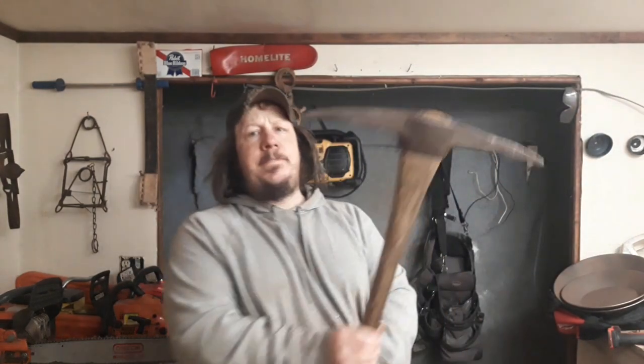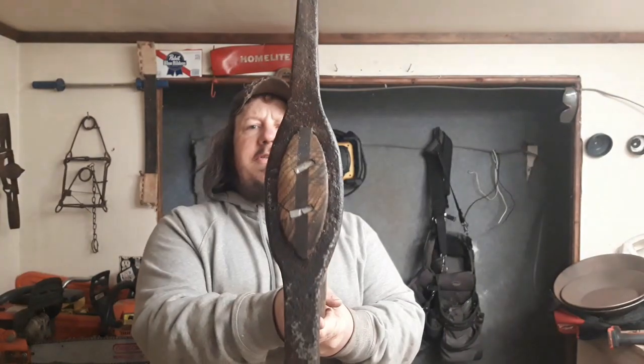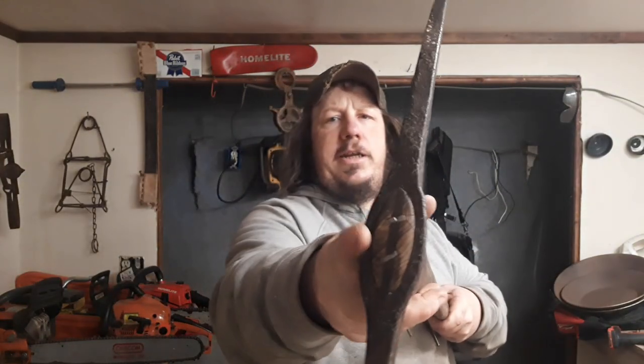It does have a steel barrel wedge in there — they come in different sizes. I got a bunch of new ones here. If you make them proud on top and smash one of these, they'll never come off because that's a lot of mass going into them. These smaller ones usually do the trick — you can get real small, pencil size and smaller. These ones don't quite fit in inside there. Then there's different size step wedges as well — little ones get a little bit bigger, then just drive in through the top. You can put a wood wedge down the center of the kerf, a barrel wedge in the center, or like we did on here, two step wedges.